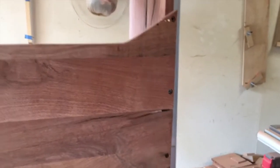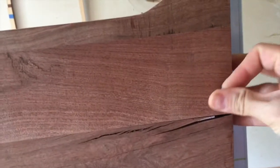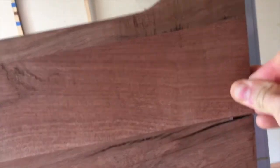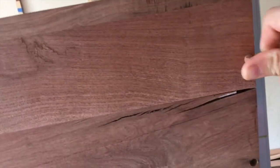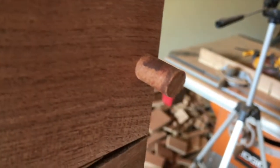So how well do they fit? I'll show you. Here's the bookcase I'm working on currently. Here's the back piece — and right here, that's a pretty tight fit. I have to hammer it in, but it will go. So if you use the right size drill bit and the right size dowel maker, they actually do work really well. That is a tight fit.